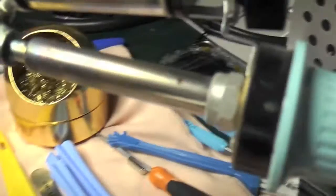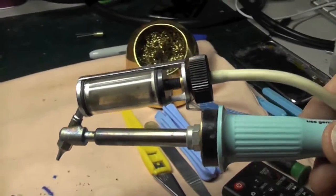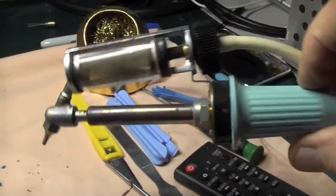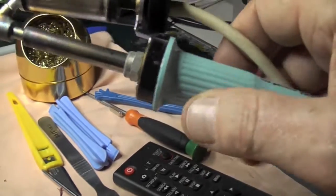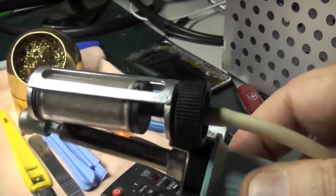I'll show you something interesting about the Weller desolder station. I don't know how old this is but it's rather like soldering. The button there basically applies suction. The tip is hollow, and that little bulb on the top glass tube collects the solder. The idea is it heats up the solder, melts it, you press the button and it sucks it off the board, catching the excess solder in that tube.